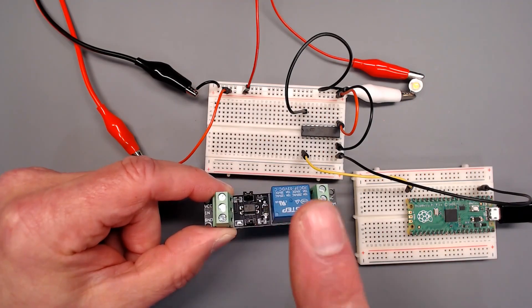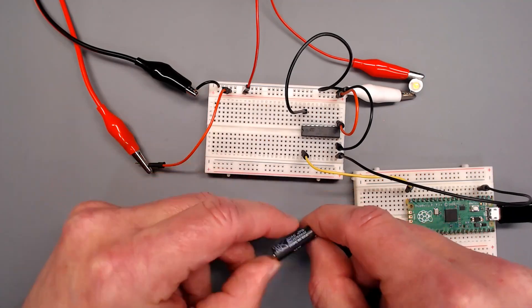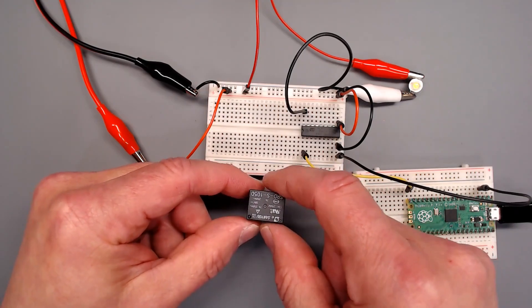So what they're talking about is just the relay itself — just the blue piece, or another example is this reed relay. Those don't really require a lot of current, but there's what's called the flyback issue — that inrush of current coming out of the electromagnetic field as it collapses around the coil that actuates the relay or solenoid. When that field collapses, it creates an inrush of current through the logic side into the Pico. It's momentary, but it can be very strong and very damaging to any logic circuit, not just the Pico.